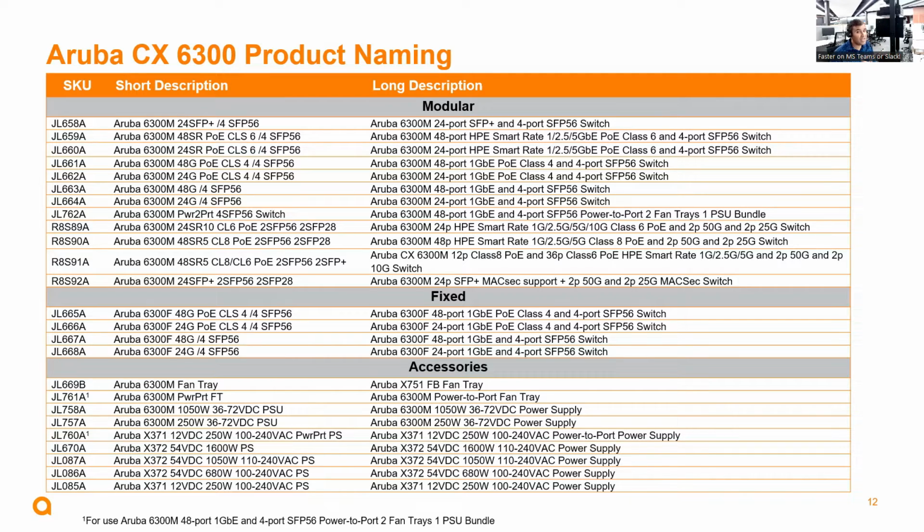Our product management and engineering have done an awesome job. But I would like to brief you on a few things because you would like to understand them. As soon as you connect this power, you might be thinking all the switch requires that much power. Remember, power management on this board itself is big engineering. As soon as you connect power, 120 or 240 volts, it becomes 12 volts, right? So with the 12 volts, don't think that every circuit in the motherboard needs 12 volts. That has to be managed, and some boards need 1.3 volts, some need 1 volt, some need 3 volts. It has to be managed. That itself is big engineering.